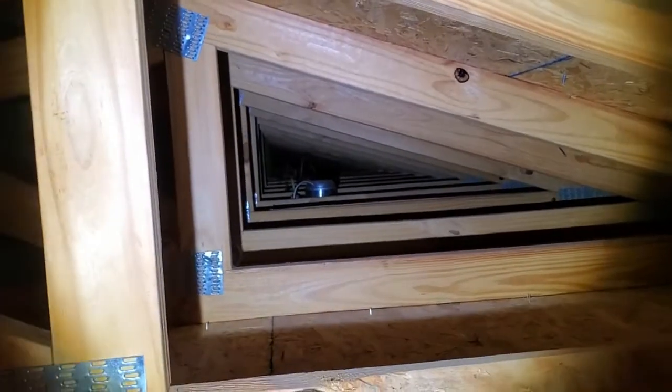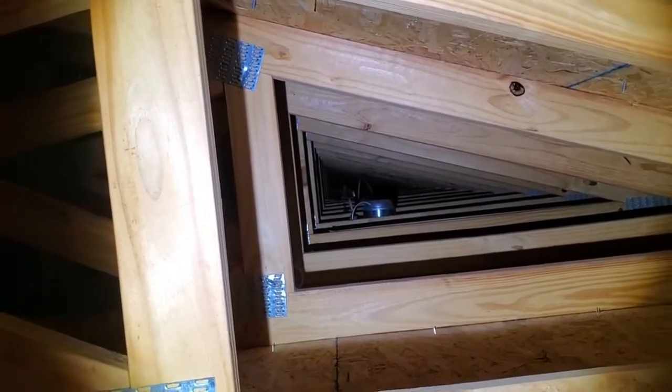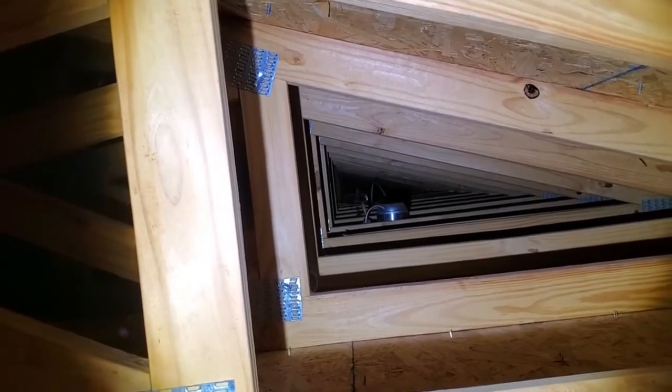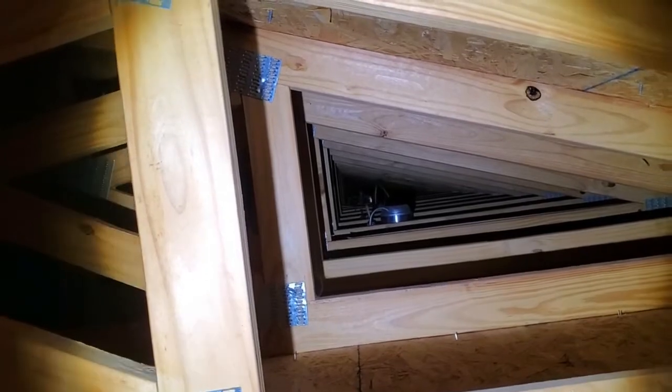Here's the device up here. I do have power — you can see those yellow wires down there. Some of them are for the porch lights, but some are for the ceiling fans. The ceiling fans are powered all the time and I don't use them, so I could add an outlet to that without having to run anything new.